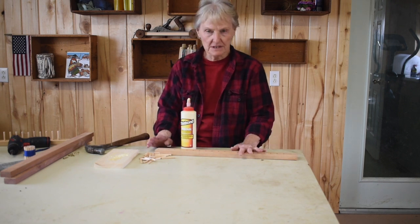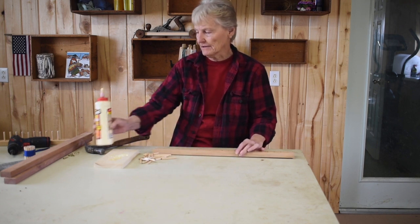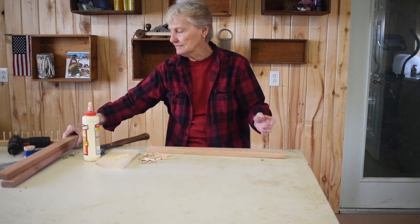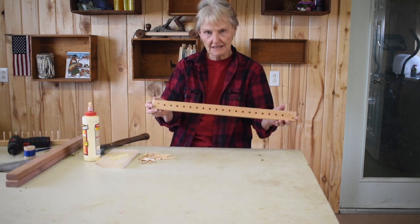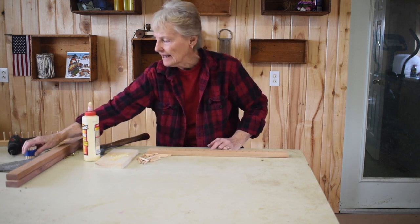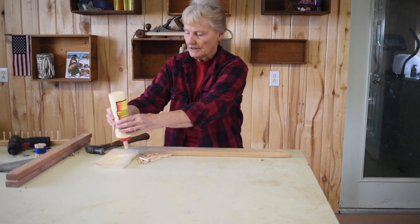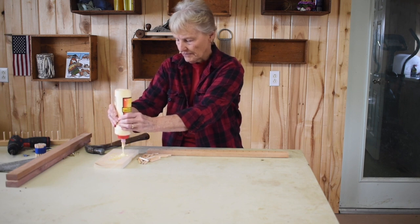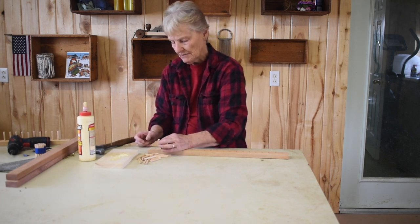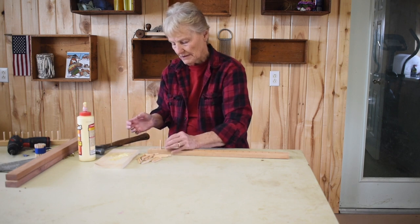I've moved from my woodshop into my finish room because my woodshop is so large and has so much metal in it that it echoes, so hopefully the sound will be better here. I have lightly sanded my two upright bars and my two bars with the 18 holes across. Then it's time to put my pegs in all the holes. I like to cut mine in bundles — I tape them together and cut them in bundles. Then I put a dollop of glue on a board, dip my pegs in that glue, and just hammer them into the holes. Some of them are so loose I don't even need to hammer them.